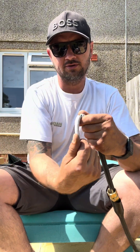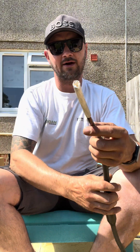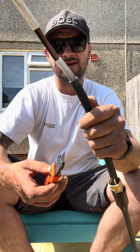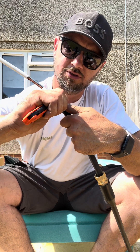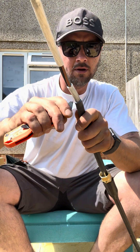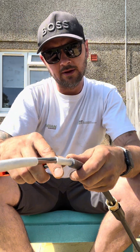Now while it's in your hand, have a think — I want it to go into the gland like that, and then you want it to come through quite a bit, so leave an inch and a half to two inches. Just score it so it doesn't score the cable and you can get that off, but then leave that on because it's going to go through the hole and it's easier to get it through the hole. So then you want to just score all the way around and then cut this off.